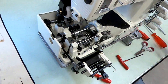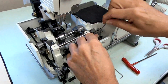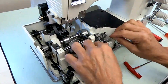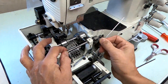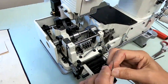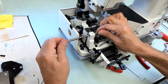You'll need a two millimeter Allen wrench to loosen the spreader bar itself. Loosen the spreader bar, then remove your spreaders — which we will use again — and slide your spreader bar out.